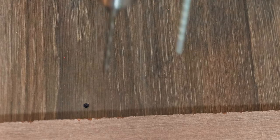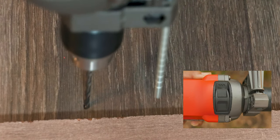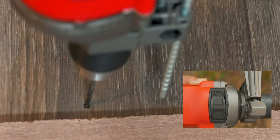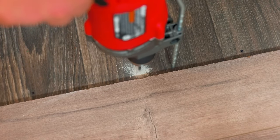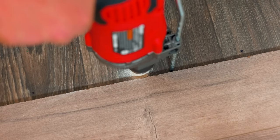Because we're going over vinyl, on the first part set the hammer drill to the drilling side. Once you cut through the vinyl, set it back to hammer drill and start hammering on the concrete. Once you feel the depth stop bar touch the floor, you stop.